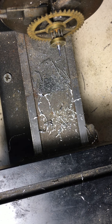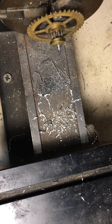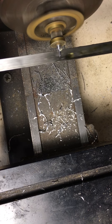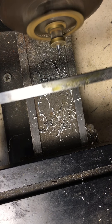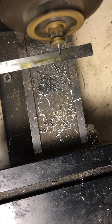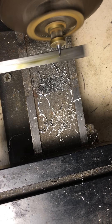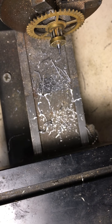Now we're going to use a burnisher. I've got a little spot of oil that I'm going to put the burnisher in — you can see the oil on the burnisher. Now we're going to spin this just a little bit faster. We're putting smooth metal against smooth metal — we're both hardening that pivot and making it very, very smooth. Now that pivot is just as smooth as can be.